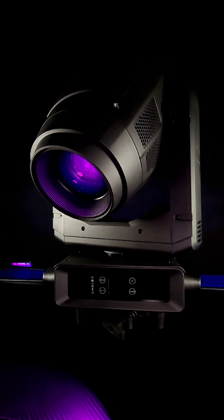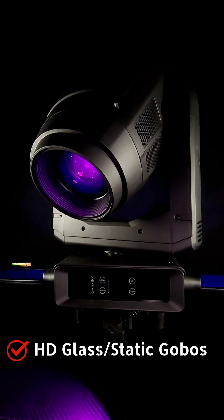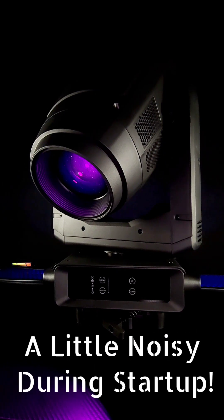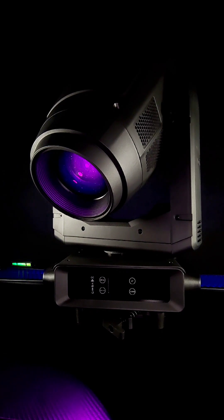If you haven't seen my review on the S712 Kuon and the S716 Goku, you can check that out on my channel. I do like all of the built-in glass gobos as well as the static gobos. I wish they would have included an extra prism, because there's only one prism on here. I would have taken the extra prism over the extra frost filter, as there's not too big a difference between frost one and frost two. During startup it's a little noisy — it goes through all its settings and checks all its motors, and when it gets to the framing it's super loud, so just giving you a heads up on that.